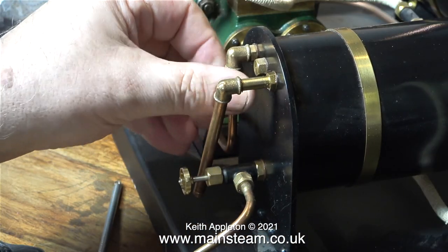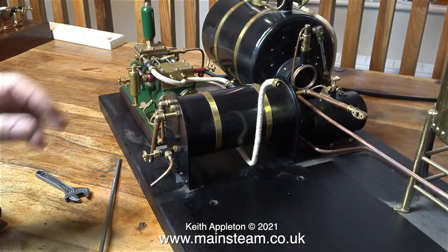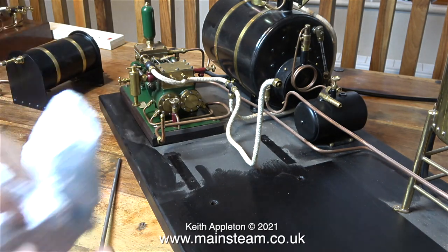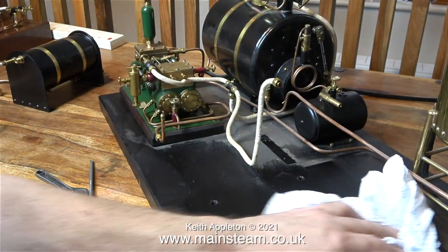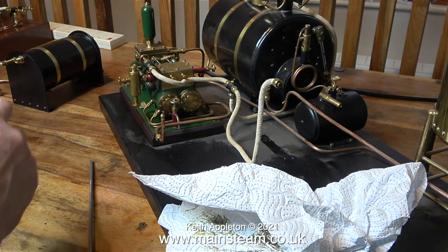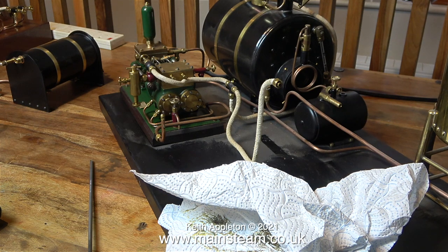On a gas-fired boiler, if the exhaust pipe went into the chimney without an oil trap, then the oil would run down into the centre flue and make a noise very much like the sound you get when they're frying fish in a fish and chip shop. Oil traps are essential also in model boats, because if you don't use one, then very soon the lake that you're sailing your model steamboat on gets covered in a nice rainbow effect of oil.